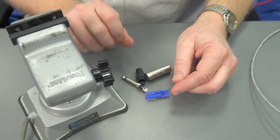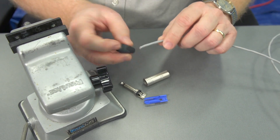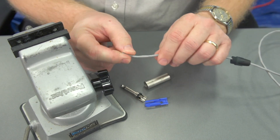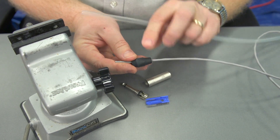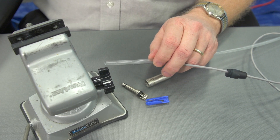Let's go ahead and begin preparing our cable. Let's get our cable and go ahead and put the boot on it. I'll save stripping for just a moment. We'll put the boot on and also use some heat shrink. I want to make sure that when all this is together, the heat shrink comes past the boot, like we do on other connectors, to provide a little strain relief.